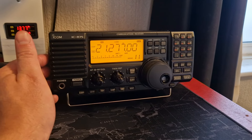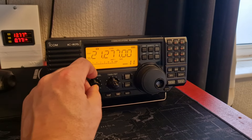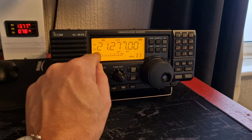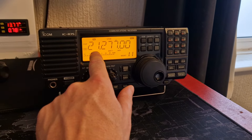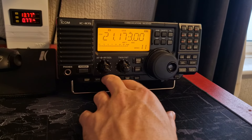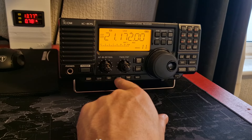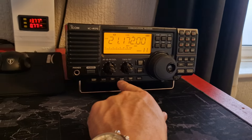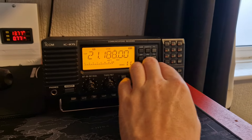The only thing I'd comment on is it would be nice to have a manual notch filter, but what's the point in a manual notch filter when you've got a really, really good automatic notch filter? That's the thing that actually surpasses the noise reduction — the automatic notch filter, the ANF, that comes with the DSP-106 module, I think it is, is absolutely phenomenal. Let me just try to get a bit of a tone — there, straight off. And it does alter the audio slightly, but not more than a manual notch filter would. Really, really nice.